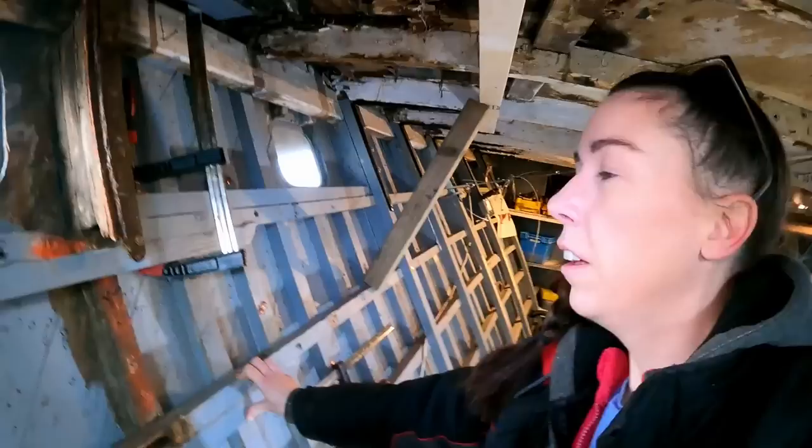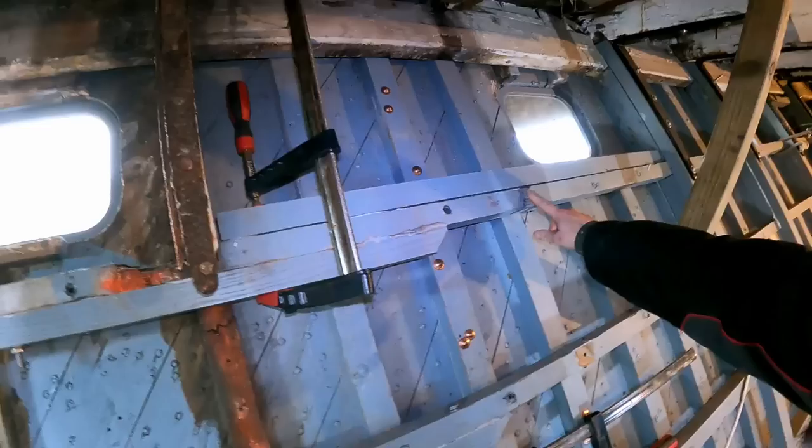So just whacking in another sister stringer because Simon wasn't too happy about this little bit here. So we're just gonna sister it all the way along.